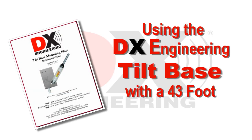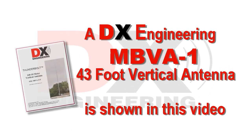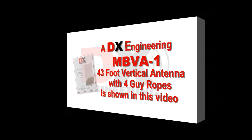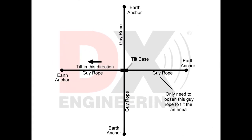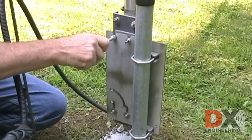This video will show the DX Engineering stainless steel tilt base being used on a 43-foot vertical antenna. The antenna shown is a DXE MBVA-1, slow taper, 160 to 10 meter, 43-foot vertical with optional unun and radial plate. Since this antenna uses a four-rope guy system, only one guy rope needs to be loosened when tilting the antenna down. Remove the one-rope guy opposite the tilt direction.